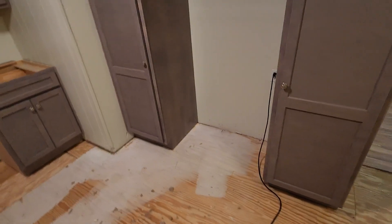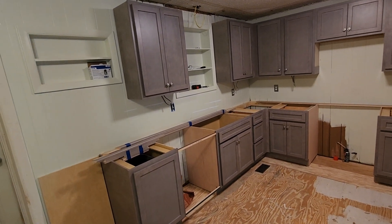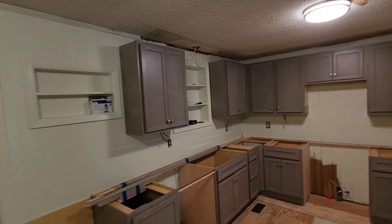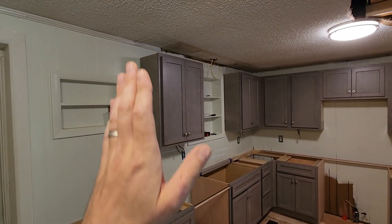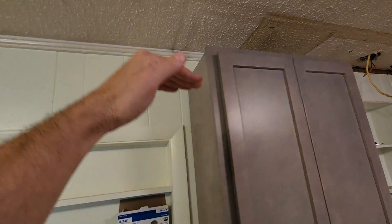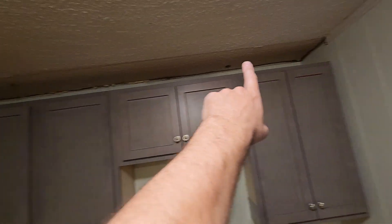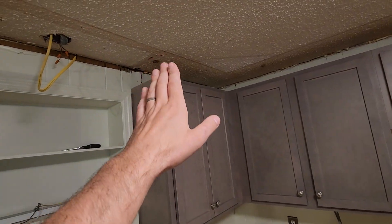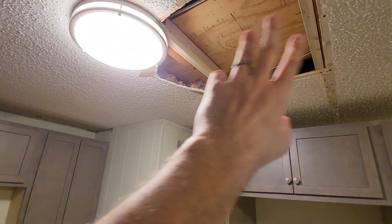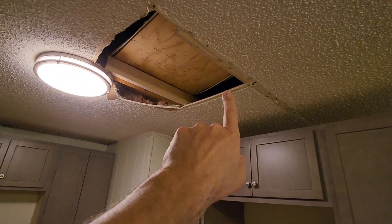So it's accommodated the new layout. For our return trip, we're going to be doing some riser molding — we're actually going to use the toe kick that we have on site to create a riser. This is something we changed from the original design because the original cabinets went to the ceiling. We wanted ours down further so that we'd be below the house crown. But the ceiling here has some staining from where the old cabinets were, and there's also a spot where the contractor came through while doing electrical in the attic, so they're going to have to do some patching.